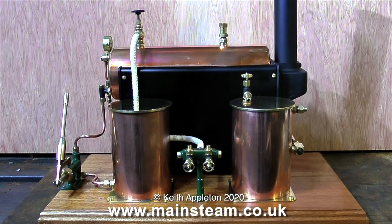This is a Stuart 504 boiler built into a steam plant quite a while back. The first part to look at is the condenser oil trap. Although not essential, it's very useful because the exhaust of a steam engine contains oil. As the exhaust passes through the condenser oil trap, some of the steam condenses to water and the oil is left behind. All that goes up the chimney is just water vapor. If the oil were to go up the chimney it would pop and crackle like somebody frying in a fish and chip shop, and in the 500 series design the oil would find its way onto the baseboard and make a mess.